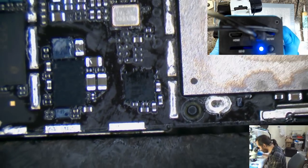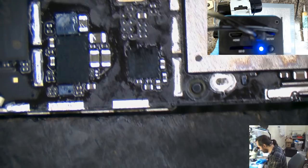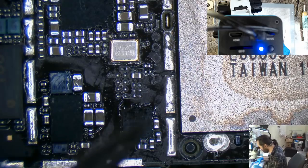Yeah. I think those balls are in pretty good condition. That one on the right hand corner, it always seems to have a bad habit of pancaking for some reason. I think what might be happening is when I try to clear the pads, a little more solder gets on there. And so it creates a bigger ball, but because it's got to go level with everyone else, it gets squashed out a bit more. That's my theory. Feel free to come up with a better one.